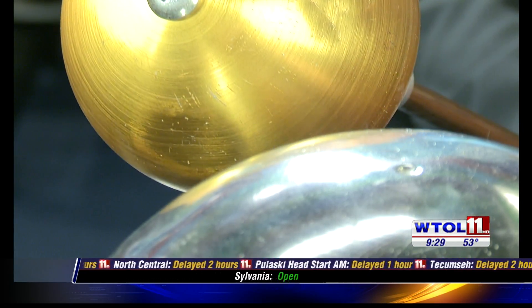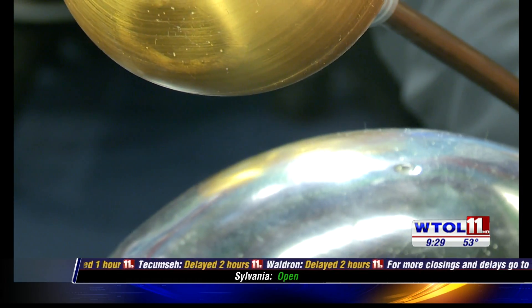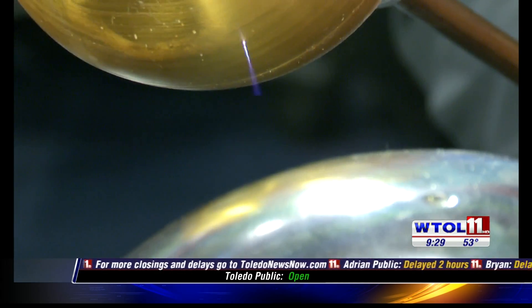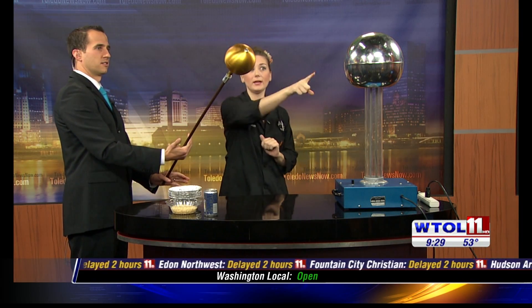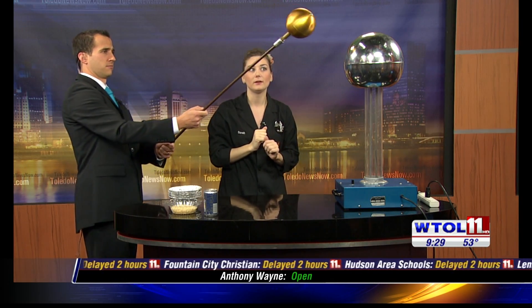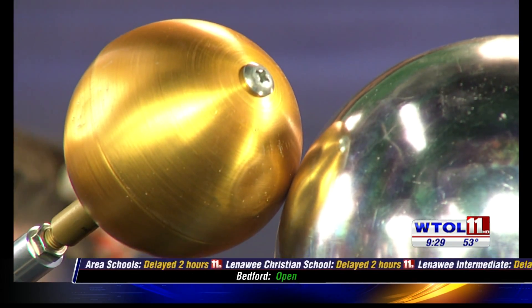What's happening is we have about 50,000 volts now transferring between our sphere and our scepter. Now I'm going to turn this off. That one inch gap is about 50,000 volts. Go ahead and touch right to the sphere — that neutralizes everything, so our charge is now gone.